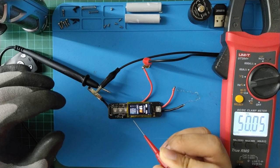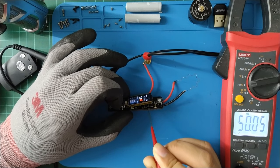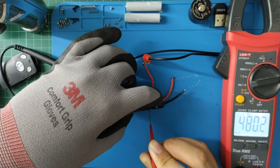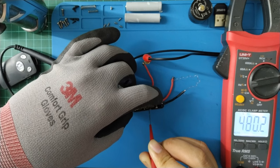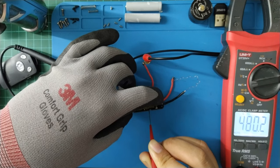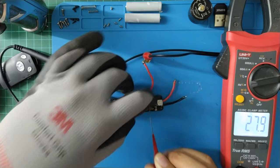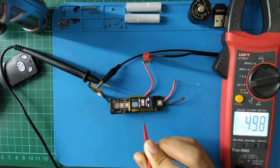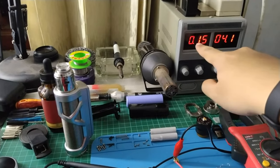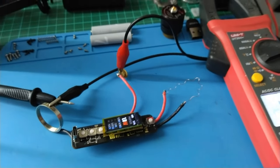Finally, let's see the main switcher frequency. The main switcher frequency is about 480 kHz — it's clearly measurable and we can also measure the duty cycle. It's about 27-28% at 1W, but for a 1-ohm coil resistance my power supply is jumping up and down when the display is turned on, maybe because it's trying to read the wire resistance.